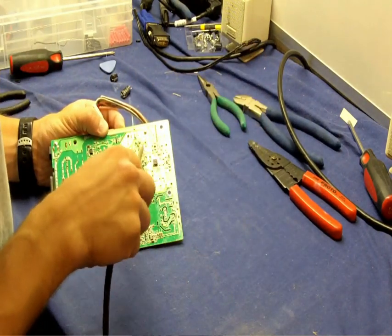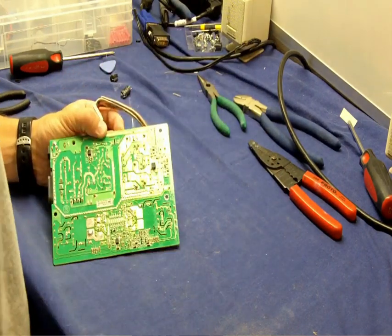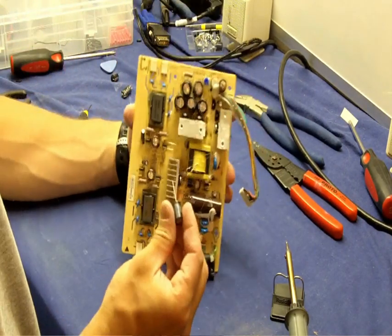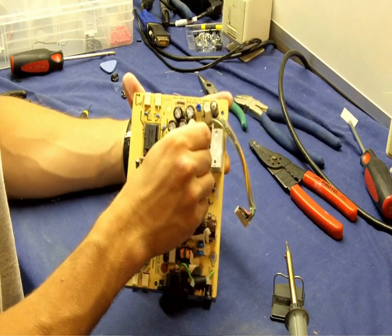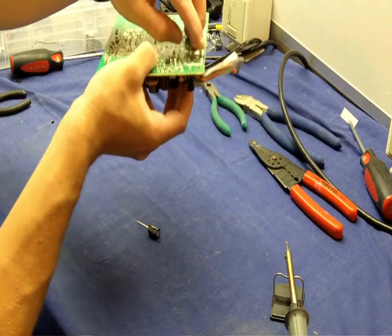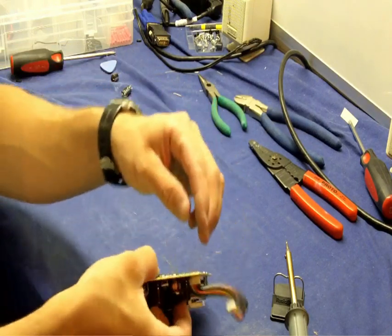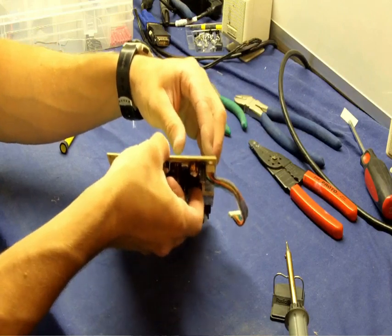The capacitors do have a polarity. If you look at the old capacitors before you break them out, you'll notice a grey stripe — that's the direction it needs to go back in. If you look at the front of the card, one half of the circle is brown and the other is yellow. Just make sure the brown side gets the grey stripe and you should be alright. Push it in and bend the legs just a little bit each way so it holds the capacitor in on its own. Don't bend them all the way down towards the board because you have to cut them off when you're done.